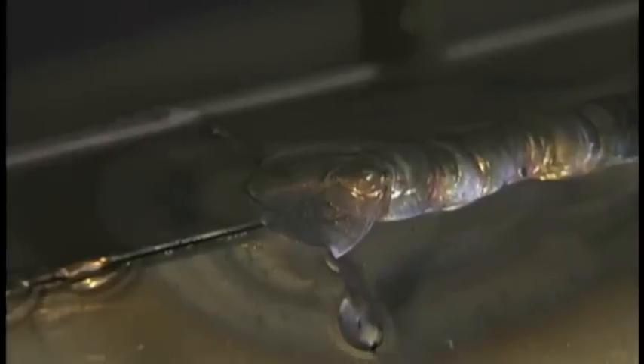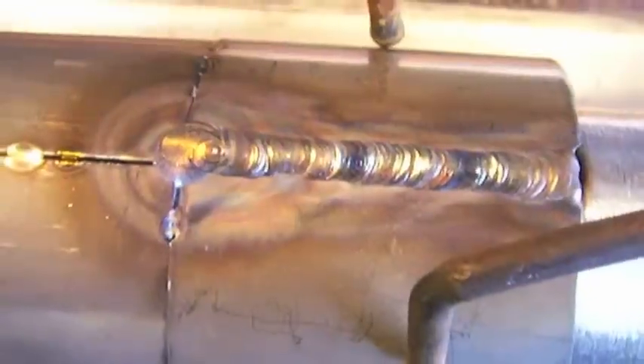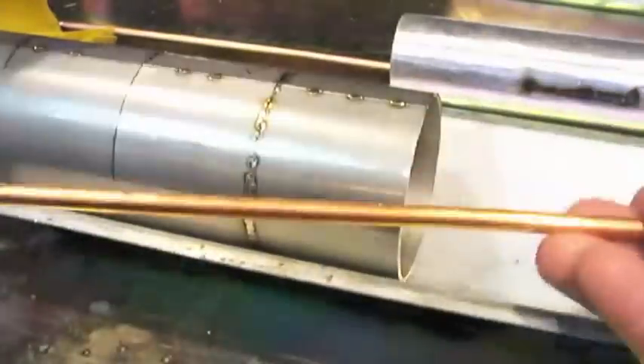I'm just about done. I want to get to the end here — I have several pieces mating up so I've got to tie everything together or it'll blow a hole out. Get some rod in there, get it all fused together. Taper off nice and slow so I don't leave a crater hole. Obviously with a quarter-inch gap this is not going to be a gorgeous weld, but for a quarter-inch gap it didn't do too poorly. You can see where it sooted up on that aluminum welding right against it, but didn't melt anything. The backside looks like this — not beautiful, but not sugared.